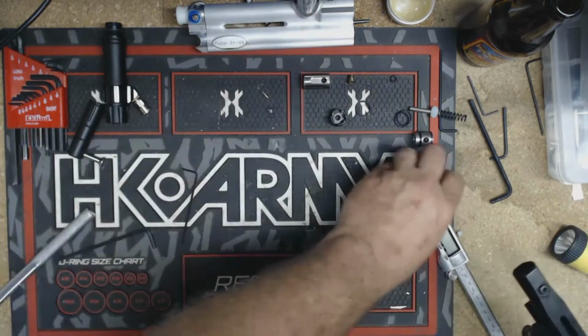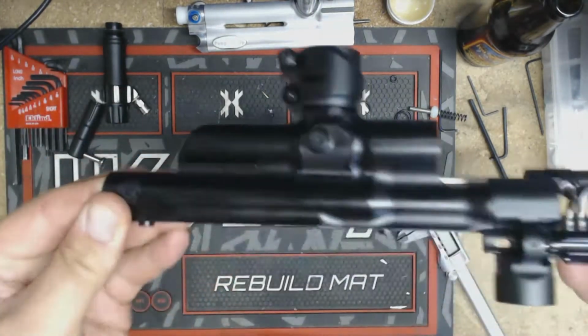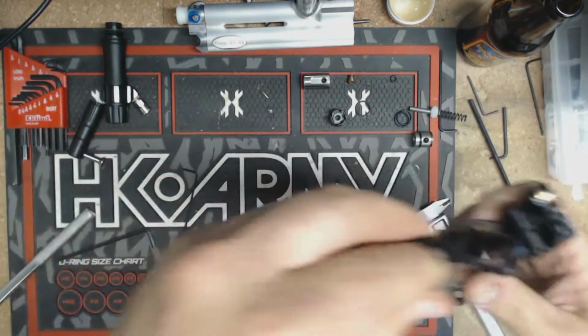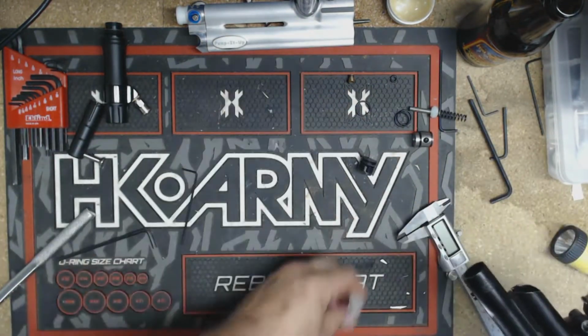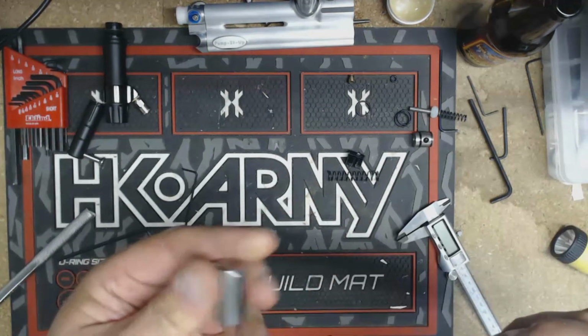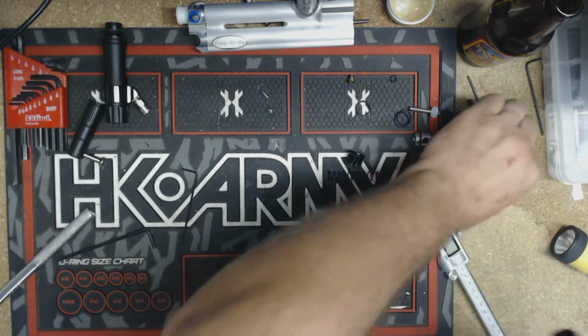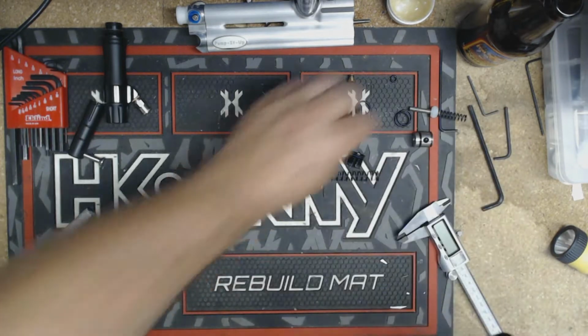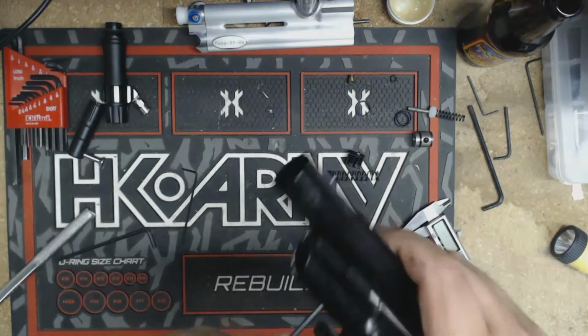So that's all in there. Now, one thing, I valve in, let's drop the mainspring in. So I'm using a factory mainspring. And this is one of the Inception Designs flea bodies for the Resurrection. Oop, usually it helps to put the hammer in, right? I think I knew what I was doing, but sometimes I don't, I guess. And this is my 1/8 inch right here. Just kind of gauge where this needs to be.